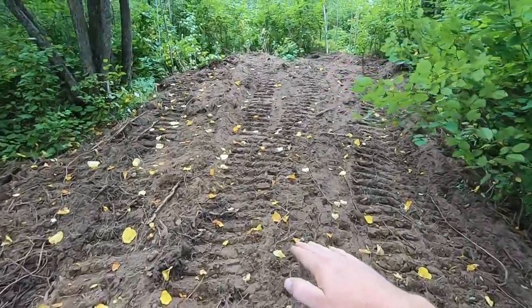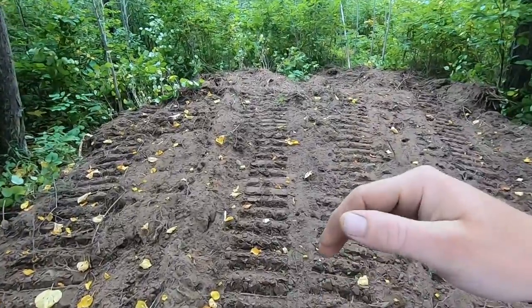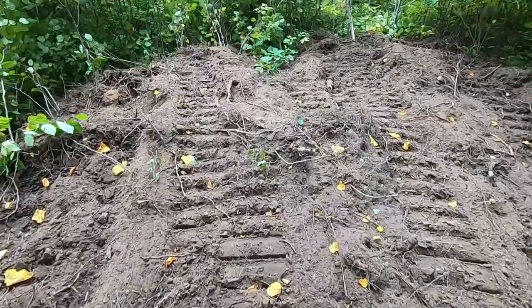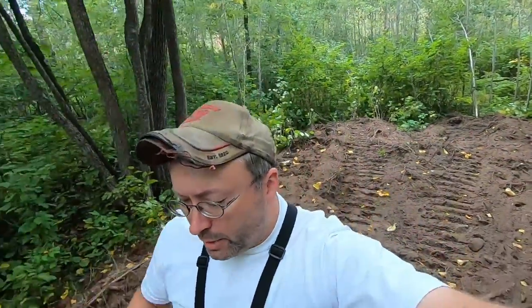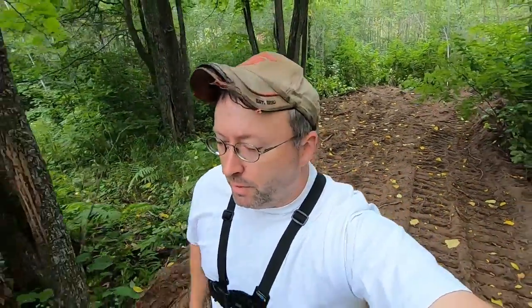We get out in this area, I'll just raise the blade slightly, about an inch at a time, and then this is where I want to funnel that material under the blade, under the tracks, and I'll come out here and I'll lift the blade and feather it just about the time I run out of material. It sounds fairly simple, but on a machine that's as short as a D2, you're always trying to balance that bubble. They're really, really hard to grade with.